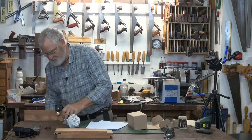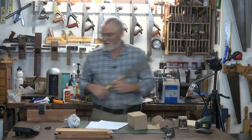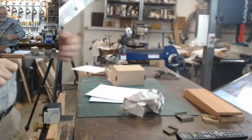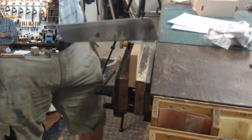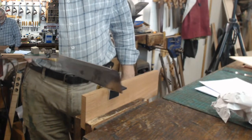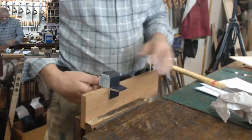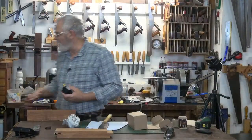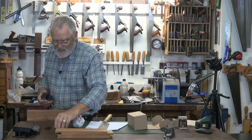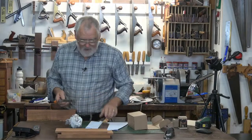But just see how wonderful this is. These were around when my dad was alive. I reckon I would have bought him some. There we go. Okay, so that is the angle. See if we can get a better shot. That's the angle of the dovetail, and look at this. It's a magnet. So you just lean your saw against the jig and start cutting, and you will be cutting perfect dovetails every time. And that comes in a 1-in-6 and a 1-in-8 as well. So there's some opportunities for you. Or failing that, if you don't want to do the jigs and you want to do it the way I did it.